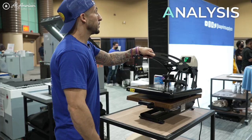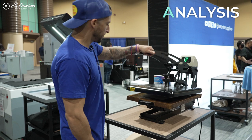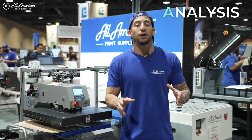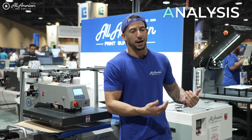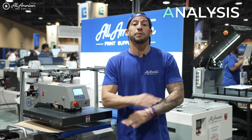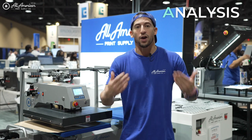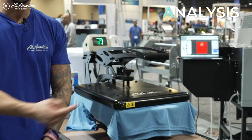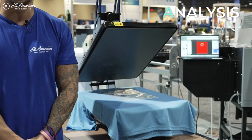And what about the drying? The heat press method — we talked about it being time consuming and halting our production, not pressing any transfers. The heat press should be doing what it's made to do, what its name implies: pressing heat. The oven or the conveyor dryer is going to be hands-free consistency, drying that evenly for us each and every time. And with the use of the conveyor dryer or the oven, my heat press is free to continue production — no stops, no halts, no breaks.